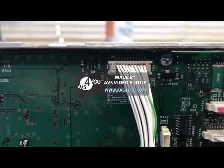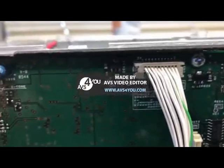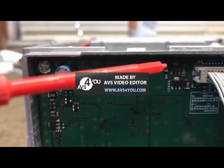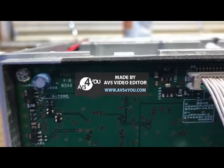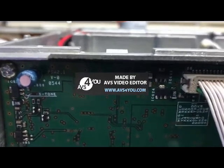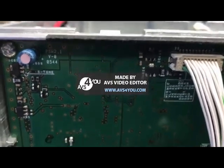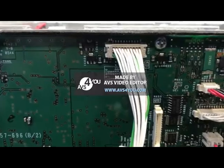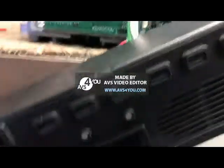I found IC628 right here. On the output it's down to 1.8 volts — should be 5 volts. That supplies another IC that controls the DSP, which is the TX and RX audio run circuit. We're going to try to change that out, see if we can resurrect this thing.